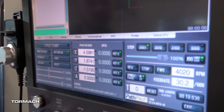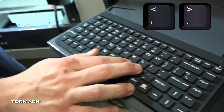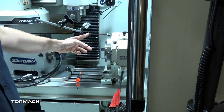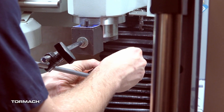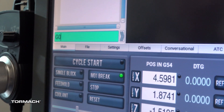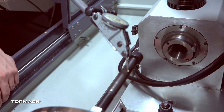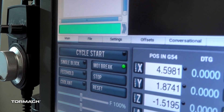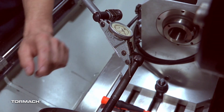I like to use the arrow keys on the keyboard to rotate the rotary manually. Rotating away from the indicator in the counterclockwise direction, then rotating to a position I like clockwise — leave it there. Zero my A axis. Engage my indicator. Set my indicator dial to zero. In PathPilot, I'm going to type G0 A3 — that'll make the pin move away from the indicator three degrees. Now I'm going to type A0 into MDI and hit enter, and it'll move right back to the indicator. That adjusted about two thousandths — maybe one thousand seven tenths. As you can see, I'm just over a thousandth on my indicator, so we have about a thousandth of backlash.